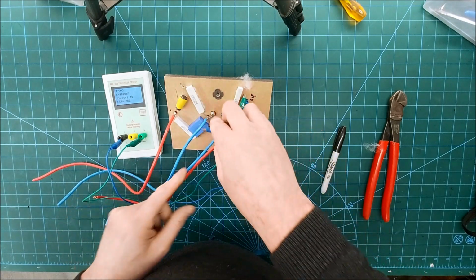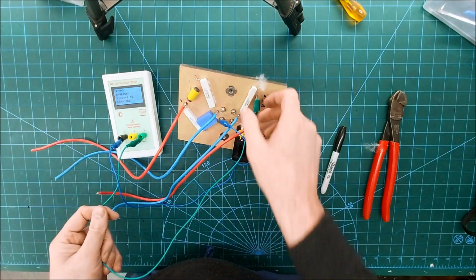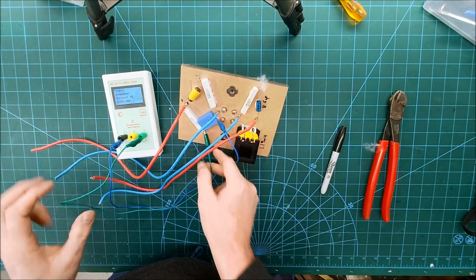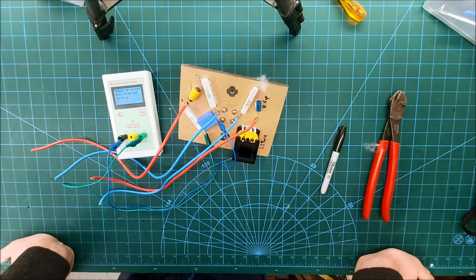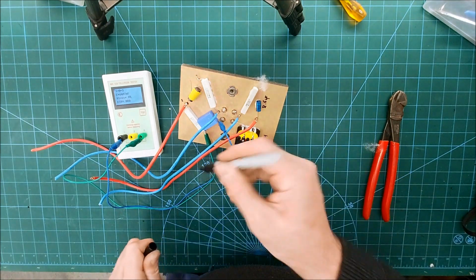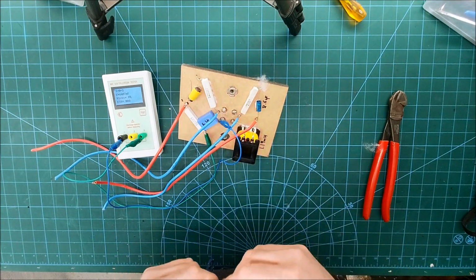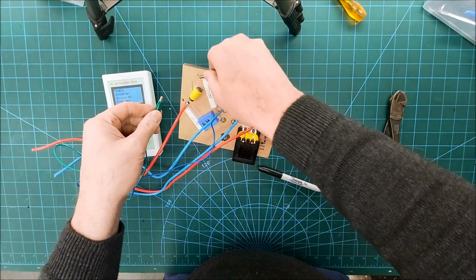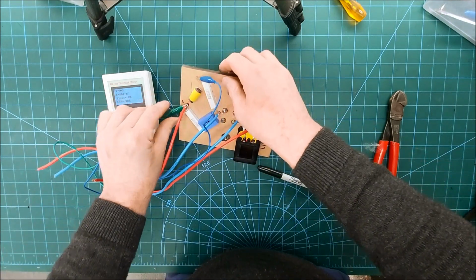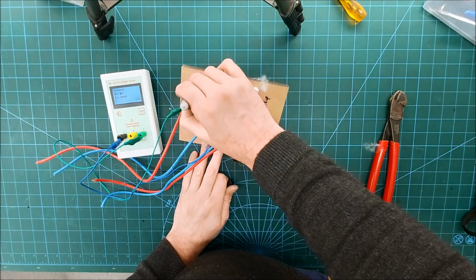Right, let's have a look at our tweeter circuit. So I don't know what this cap is value wise. I can't read anything off it. Let's see. 6.4. Then we've got a teeny tiny inductor here. So yeah, simple crossover, no correction, notch filtering or anything like that. 0.24.